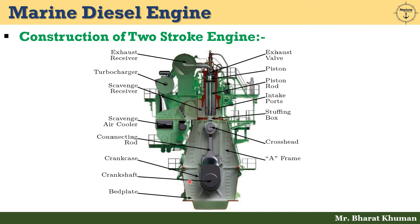The bed plate also collects the crankcase lube oil and transfers it to the sump tank from where the lube oil pump can take suction, fastens the engine to the tank top transmitting propeller thrust to the hull structure, and contributes to the hull strength of the ship at the engine room bottom structure. The second component is the crankshaft, which is the intermediate part of a marine engine that transfers the power of a firing cylinder from the reciprocating piston to the rotating propeller.